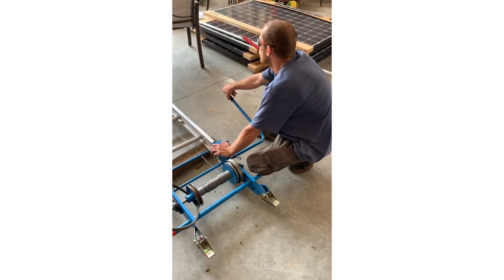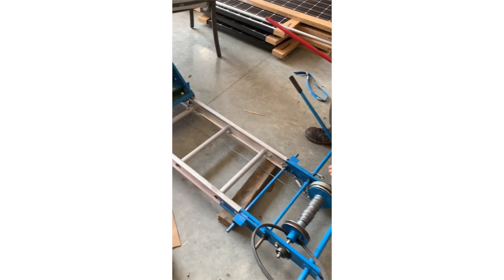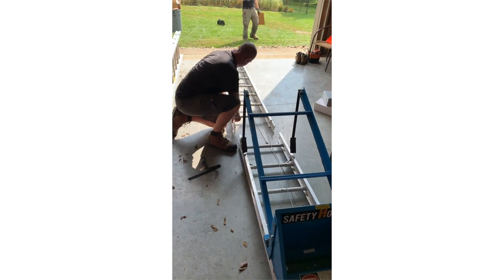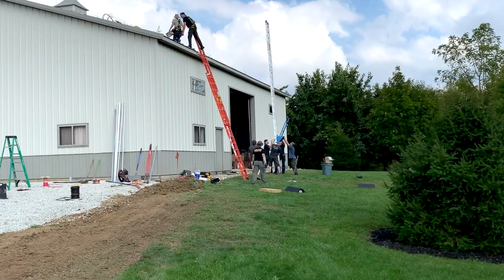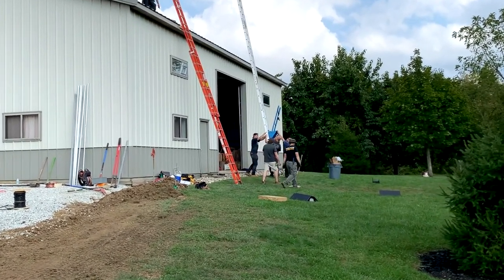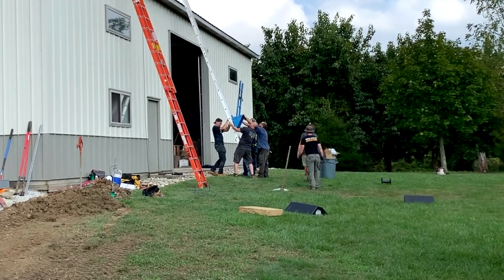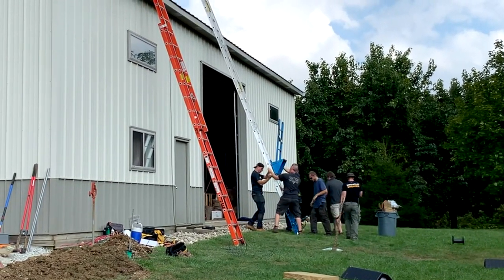The ladder safety hoist — back in the day we did some silly things, carrying modules up ladders, non-OSHA compliant. For several years now we've had a ladder safety hoist, and it makes all the difference on a project like this. If the project were of a substantially larger scale, we'd be renting an articulating boom lift or an extending boom lift — also known as a lull — to bring a pallet of modules right to the roof. But with rental, delivery, pickup, and fuel costs, those things run a little over $1,000, so that cost-benefit analysis needs to be performed. Let me dissuade you from being a he-man and attempting to hoist tall ladders by yourself — that's a recipe for an injury. Always ask your teammate for help.